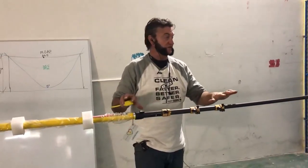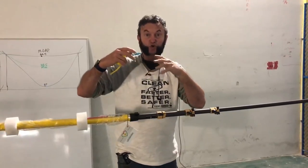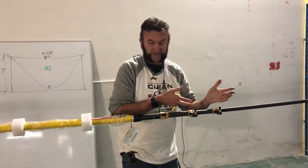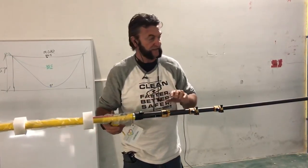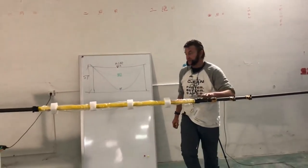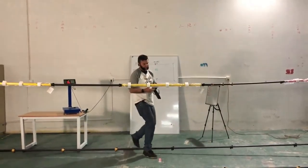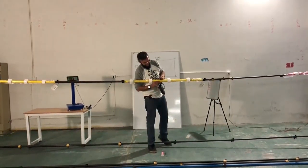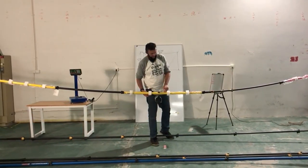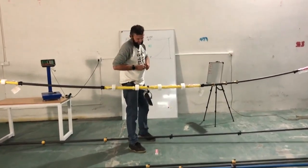So at Reach It, what we did is we made a higher modulus extension, so they add core rigidity exactly where you need them in the pole, where the pole goes to flex. So you add plus A first and then plus B and then another plus B into the mini, and you've got a 50-foot pole or 55-foot reach. So these are made of a higher modulus carbon fiber than the mini. So when we put the weight on here, the same weight, you can see it's going to wander a wee bit, but that's okay. And we can put the tape measure on this.